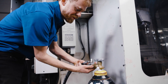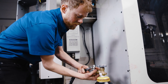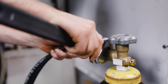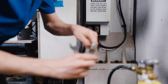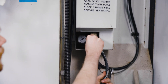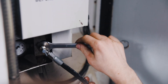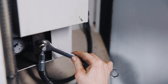You'll need a large crescent wrench for the tank end, and you'll need an 11/16ths for the Schrader end. Don't over-tighten the end on the tank — it's just copper. Now take your 11/16ths, verify that the T-nut is all the way out, and go ahead and screw it into the little Schrader. Verify that the Schrader valve is tight.